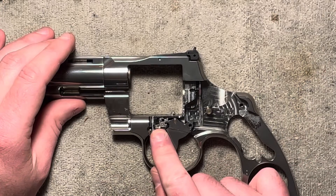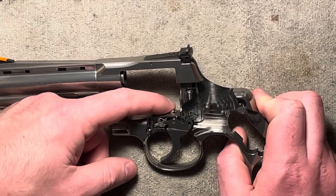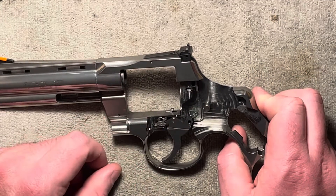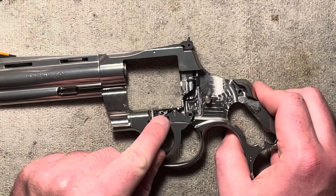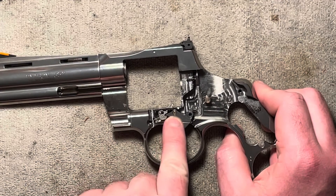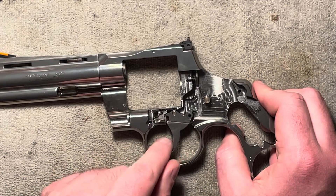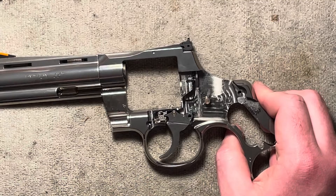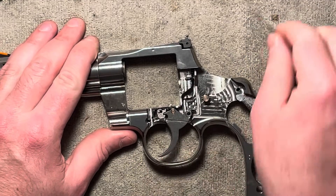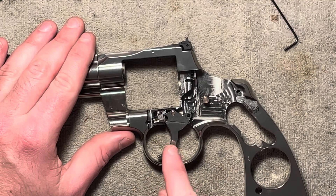What you have here is a little coil spring and a foot that is inside of the little cylinder pocket. You have an oblong hole in it that sits on this pin. You kind of have this notch in the back where a little foot from the front of the trigger fits into. And you have an angled surface on the bottom of it — you can see that it's angled upward. Now this does two different things depending on what the trigger is doing to it.